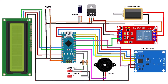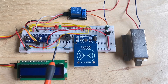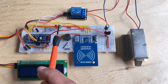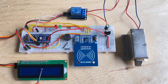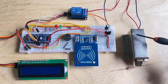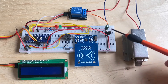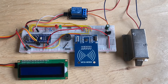On the basis of this diagram, you can assemble the circuit on a breadboard. Here is our circuit assembly. The Arduino Nano is the central controller. The RFID RC522 is connected to the SPI pins. We have a passive buzzer and a pair of LEDs — green and red — connected to digital pins using 330 ohm resistors. The I2C LCD display is connected to the I2C pins. A 5V relay controlled via a digital pin is used to control the solenoid lock, which is powered by a 12V supply. A 7805 voltage regulator IC with a 100 microfarad capacitor is used for voltage stability.